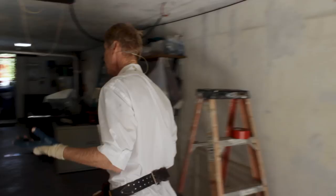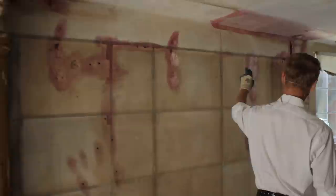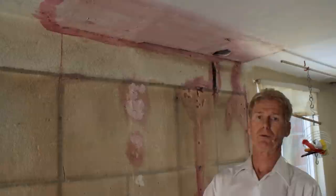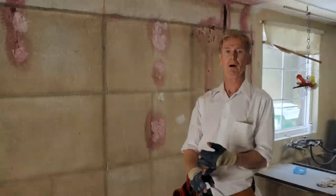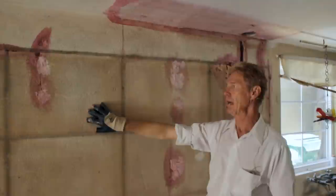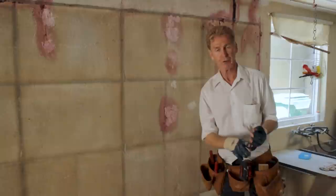Let me show you a few other things since we're talking about this kind of stuff. We've got a lot of little holes here and there — they're everywhere. And where they have this right here where it's really smooth, we've got this pink bonding agent. It's Plaster Weld by Weld Crete. If you go to Home Depot or Lowe's, you'll buy Quick Crete because they don't sell Weld Crete there — you have to go to the plastering yard. This pink stuff is so that when I plaster this, I'm going to skim it to give it a sandy look. Structolite base coat is sandy — it's used for hospitals and schools and has been used for well over 140 years.